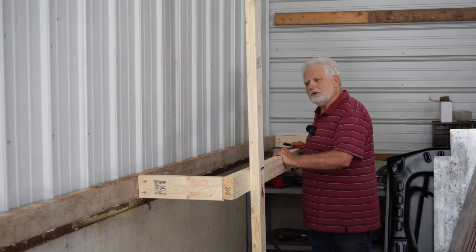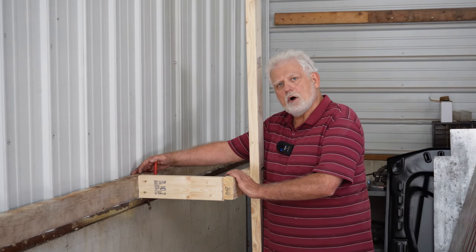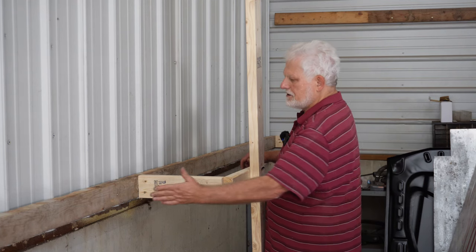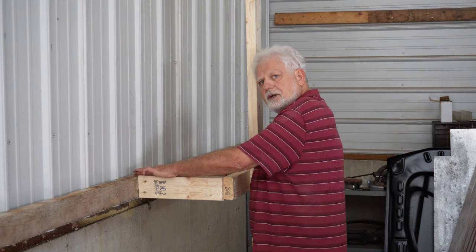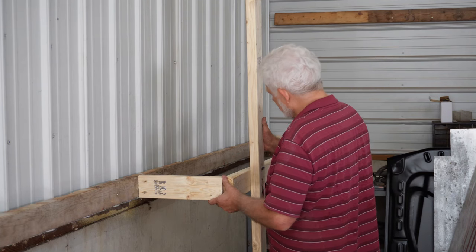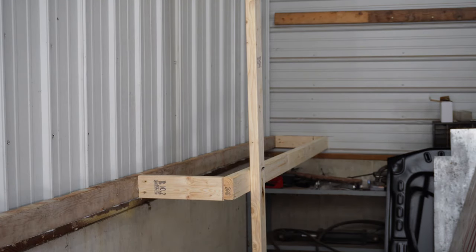I went to the local lumber yard and got some more lumber. I want this to be 16 inches from here to here so I can get three pieces of shelving board out of one 4x8 sheet of OSB — saves a little bit on material. I cut this so it fits exactly 3 inches less than 16 inches, so this is a 13-inch block. I measured from that wall to here and put an 8-foot mark; I want this block right in the center. I put this up temporarily just to hold everything in place — I've got another block there and a block at the end.